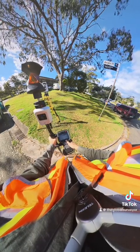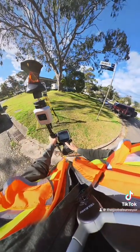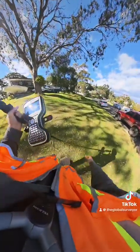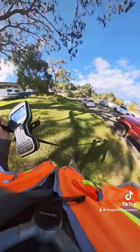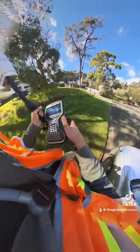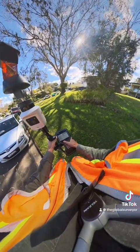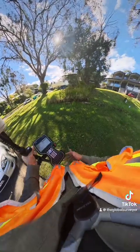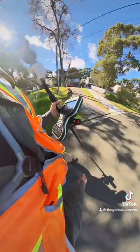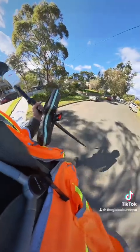Because it stopped, it wouldn't record the point. We've got to make sure the tilt's going and measure it very quickly — that's the only way to effectively use this for setup. Because it uses tilt compensation, we don't have to worry about the bubble at all. The instrument is still tracking me, so I'm going to stop that for the time being. The reason I stopped it is because tracking consumes battery power, and I've got to go for a short walk up the road to find the next survey mark.